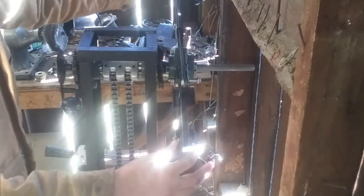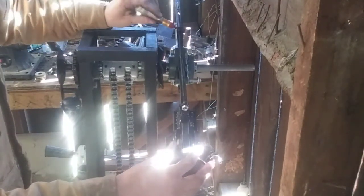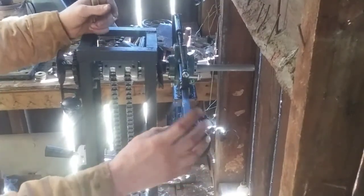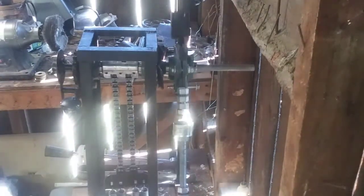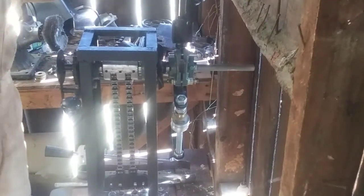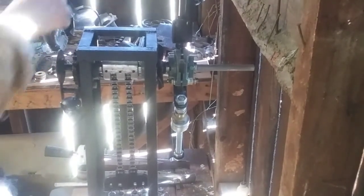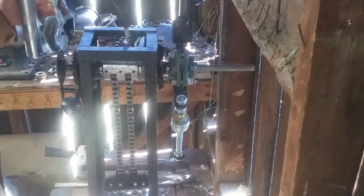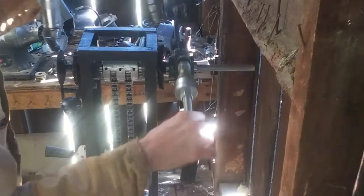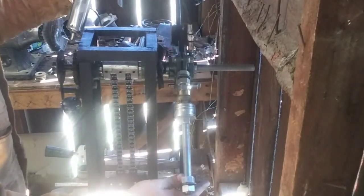And of course, you have underneath the arm, this is where you move that crucible. I put like a little dot right here of oil, and that will keep that nice and lubricated for you. Another lubrication point is going to be the pillow block bearings themselves. You've got a couple caps in here where you can insert some grease into this one, and then you have two right here. There's a cap here and a cap there just to lubricate those bearings.